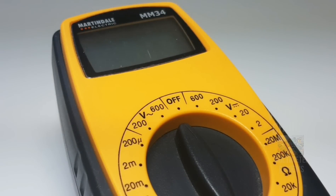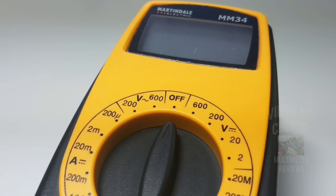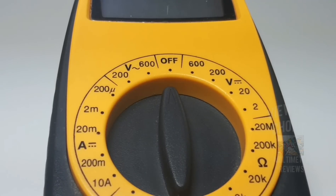The Martindale has a three-and-a-half digit liquid crystal display. Maximum reading is about 2,000 counts and it updates at a fairly impressive two-and-a-half times per second. It utilizes one 9-volt battery and has approximately 300 hours of battery life. This is a manual ranging meter. The selector switch is quite verbose — I like that yellow background with black numerics, very easy on the eyes and great contrast, unlike a lot of new meters today.